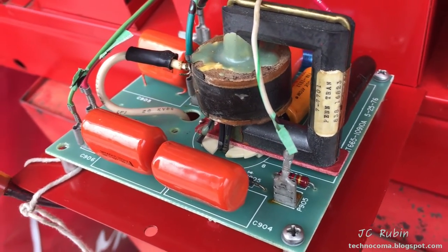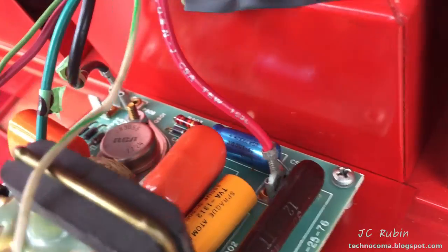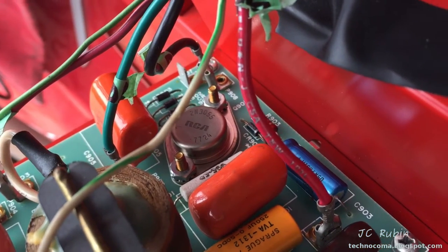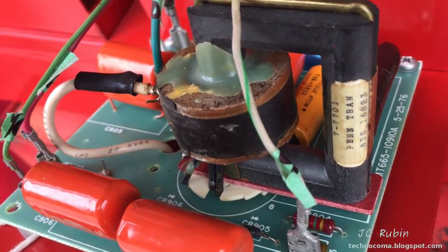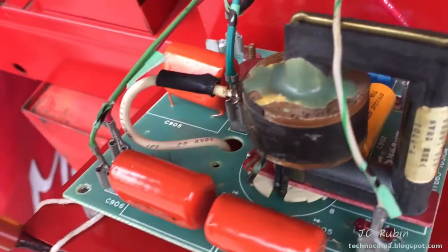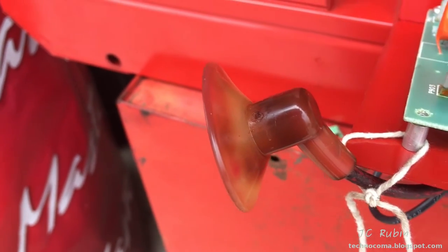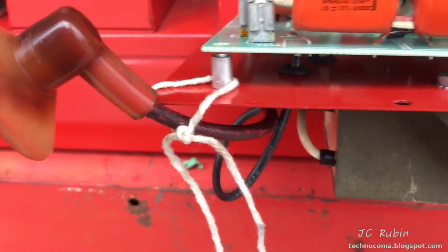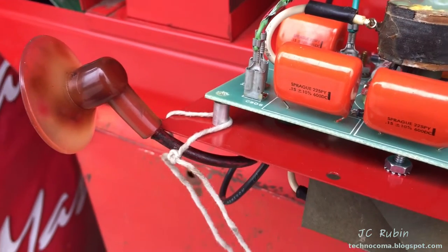The previous owner said this thing has worked at some point. I'm forced to go under the premise that if I could read voltages — which we're going to do in operation — and even though I admittedly can't read voltages directly on the transistor, I can read voltages that connect to the transistor. We should see a glow on here. The hope is obviously that the whole thing works, which it doesn't — we know that. But the hope is that I'll get a glow on the flyback transformer and not get an arc coming off the doubler or tripler. Then we'll know the point of failure is hanging off this white wire to this box, and the tripler will have to be replaced — that's our most positive outcome right now.